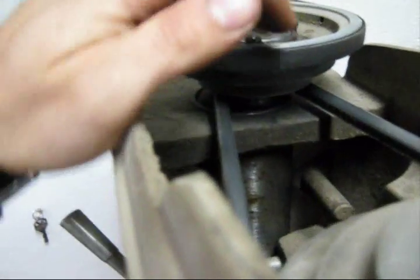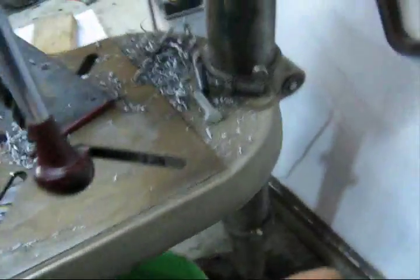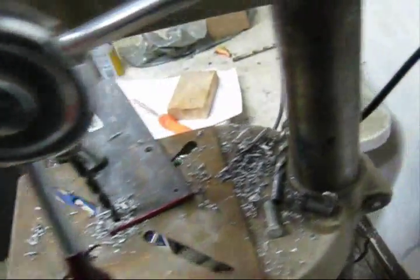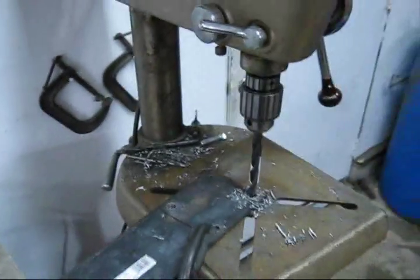You should make a good practice of having your belts loose. Because if the bit does catch and your clamp comes undone, that thing is just going to keep going around and around, and if the bit doesn't break, it's pretty dangerous. So always make a habit of keeping your belt loose on at least one of the pulleys — both don't have to be loose, just one of them.